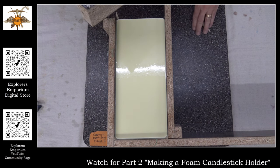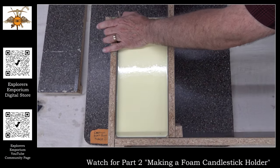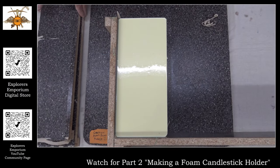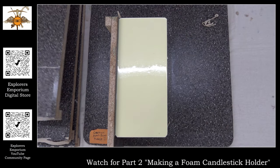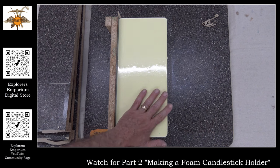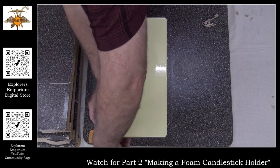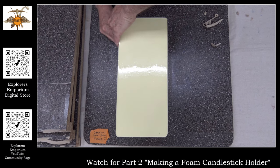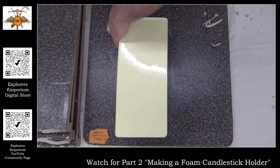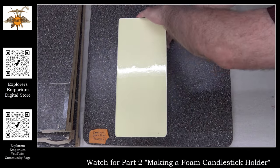Here's something cool: I've only had to buy clay once in my life. You can totally reuse the clay. If you ever get the sulfur-free clay — it's a little more expensive — you just reuse it over and over again. I had a pretty good sized brick of it and I probably still have most of it. I'll peel all that off and add it right back to my brick. Now we're going to free the mold, and if all goes well, that thing will be pretty much perfectly divided in half.